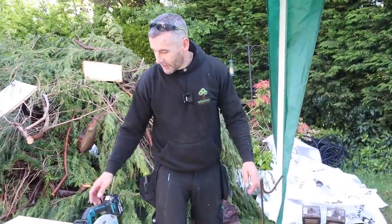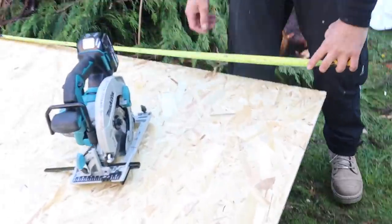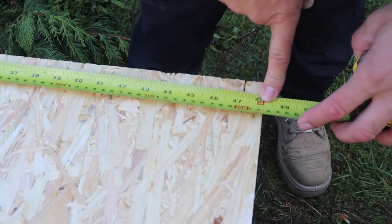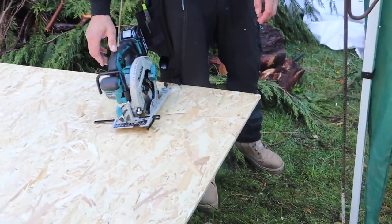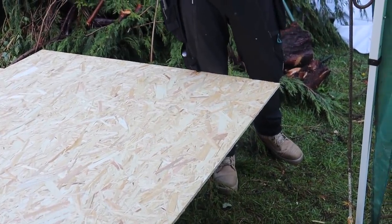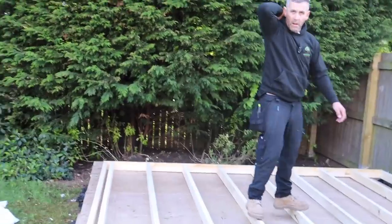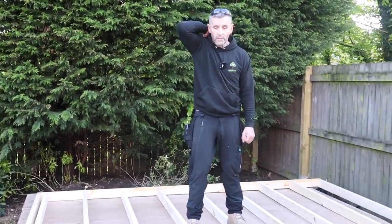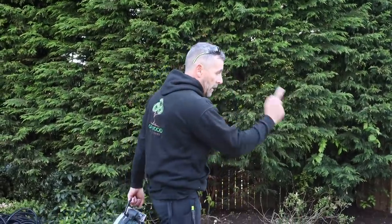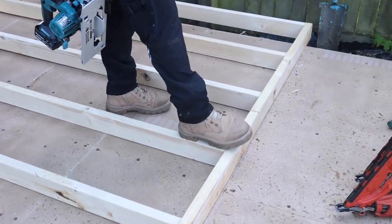I'm going to explain metric and imperial board sizes. You can get boards that are 1.2 by 2.4, but these boards are imperial — a four-foot board. Plasterboard is 1.2, so that's the metric equivalent. The supplier we get these from is still imperial and will be for quite some time; the machines that make them cost millions to replace. It's also worth noting these may be milled for other countries still on imperial — America still runs on imperial and these boards may have come from there.